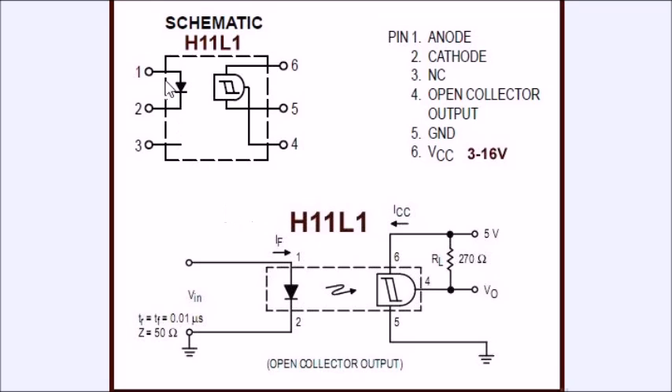Here's a little closer look at it. This is the integrated circuit. This is another test circuit that shows your electrical connections and a pull-up resistor known as RL. Connected to 5 volts, it'll give me a clean 5-volt digital output. And here are my pin connections.